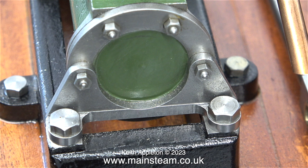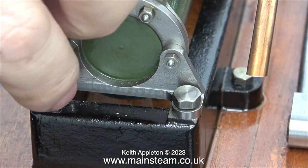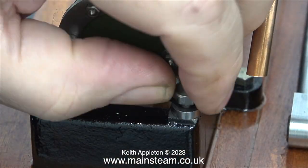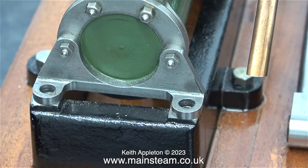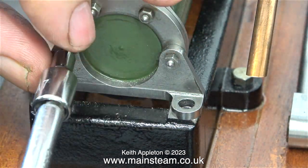Time now to find out why the pistons are sticking in the cylinders. The engine runs okay, but it makes a bit of a tapping sound. And if you leave it for a while, when you run it again, the pistons feel quite sticky inside the cylinder. These engines have never been run on steam. I actually got a compressor as part of the collection. So the problem could be that the type of oil used to lubricate them whilst running has made the piston rings swell.